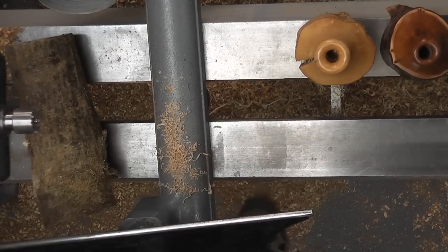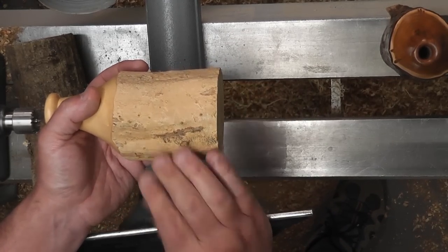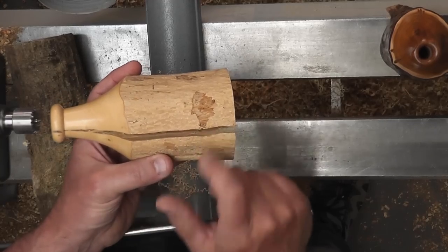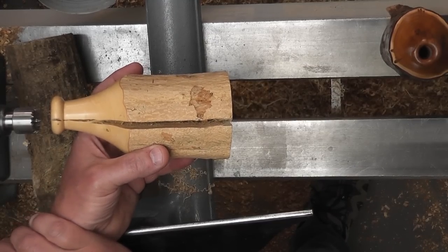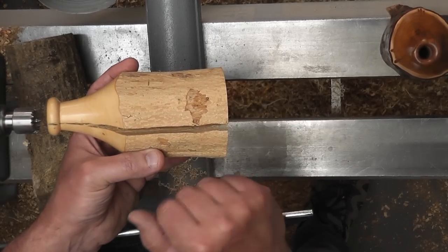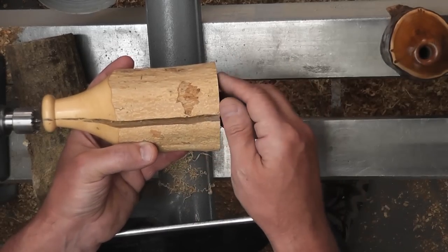We've got a lovely piece of boxwood here. Okay, so this is a piece of box. What I've done with this is brushed the outside with a wire brush, which we'll look at in a moment. But this holds a flaw in the way of a crack. I would refer to that as a flaw. But if we treat this properly, you could use the same sort of process that we use in the Kintsugi bowl and fill it with resin if you want to, or you make a feature of it. We're not trying to hide anything here. We're making features of all these little subtle imperfections. So sanding the crack out, making it purposeful.